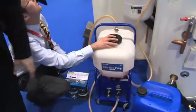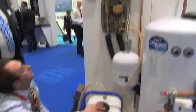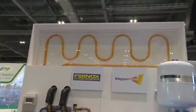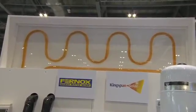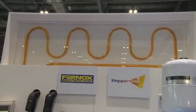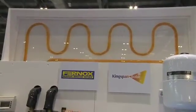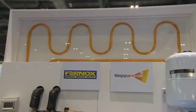The outlet of the pump is now pushing the heat transfer fluid — the Solar S1 — through the solar panel and removing the air bubbles. You've got to keep circulating and keep removing the air. Air trapped within the system could cause high heat points, fractures, and damage to the system. Allowing the fluid to flow through also removes any trapped debris, such as construction debris.